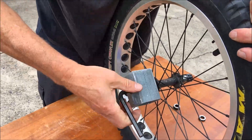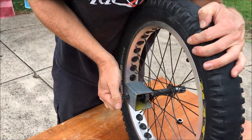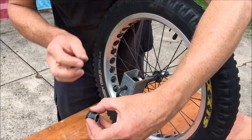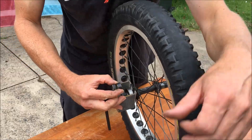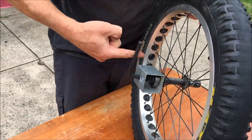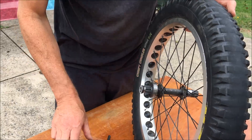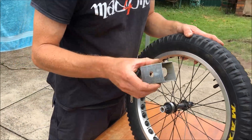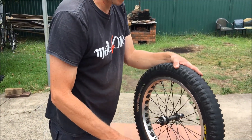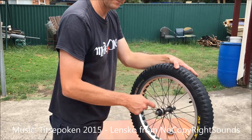There it goes! These bearings are really on the axle hard, so I may need to use more spacers to get the bearing right off the axle. But there you go — a quick little job you can do to make an easy-to-use puller. I was going to have to wait three weeks to get one from China, but that's worked and pulled the bearing. Obviously if I'd warmed up the bearing it probably would have come off a little bit easier. Thank you.